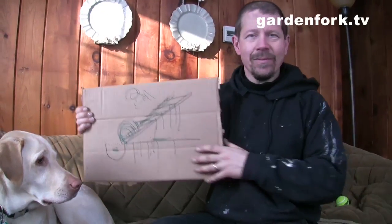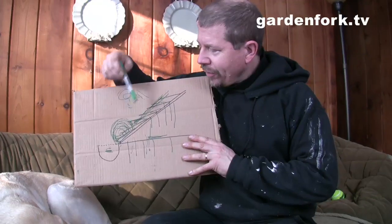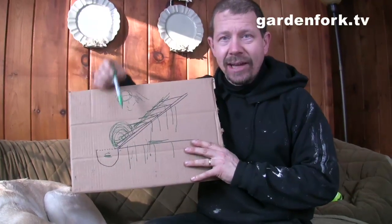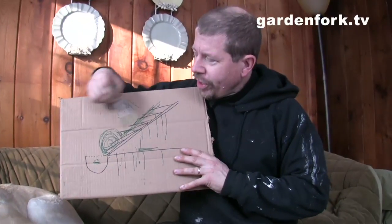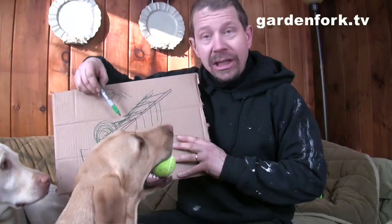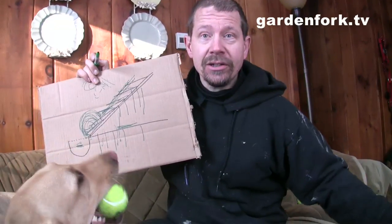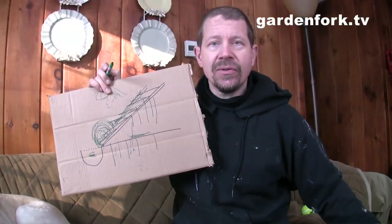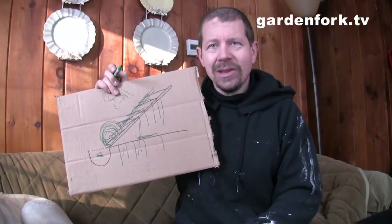So to prevent these ice dams and the water, well actually not to prevent the ice dam, but to keep that water from going into your house, when you shingle your roof, you should get a rubber membrane installed underneath the shingles. There's a number of brand names, but if you tell your roofing contractor you want a rubber membrane under your shingles to prevent ice dams, he'll know what that means, or she knows what that means.